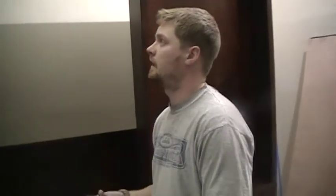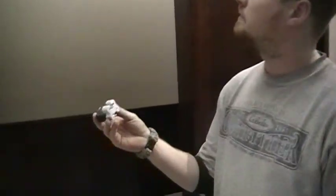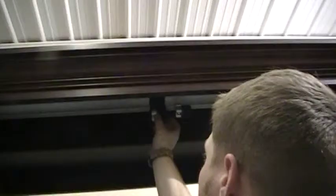On this next step, after you have the top fastened and you have your sliding bookcases on your tracking system, you want to go ahead and install your stops for your sliding bookcases so they can stop on the ends. On these right here, you're going to go ahead and slide them on your tracking system with the black pad facing in.